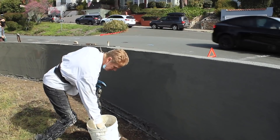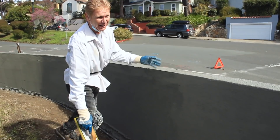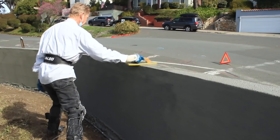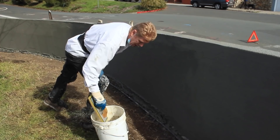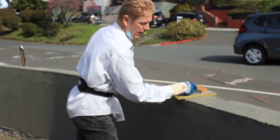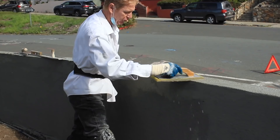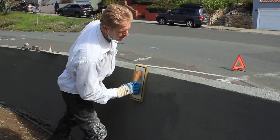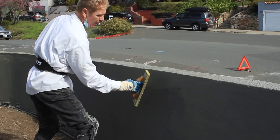After lunch — you can use a lot of water on corners because it only reinforces and strengthens them. Do you need strength here? No, it's not like kids are going to be walking up here. You take the water and put it on, let it drip — I shake it out sometimes to get the mud off. You take it and just use a lot of water. That water running off here — now you get your corners reinforced for strength. I have to float these corners: I take this sponge float and bring the sand out, so that water is necessary to bring the stucco back to life.